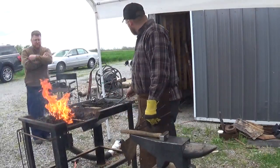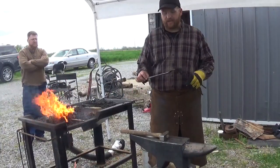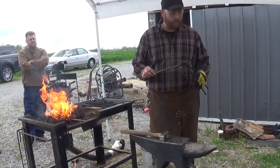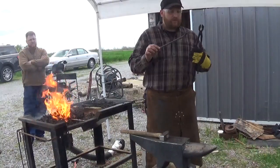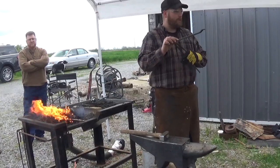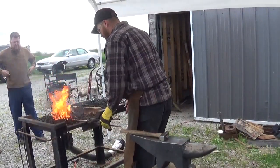I'm not doing any measurements. This is one of the nice things about this kind of tong — it's not overly critical where you make your bends. Your nib is about the only critical portion. The rest beyond that doesn't really matter. You'll see that when it comes to folding them up or putting them together.